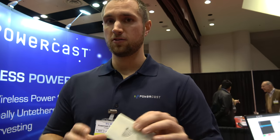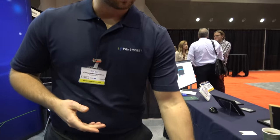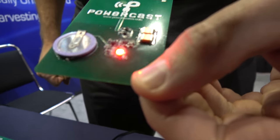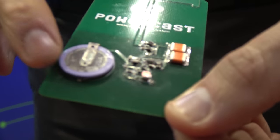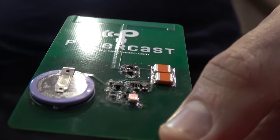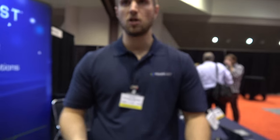It's only sensing while it gets near an RFID reader — that's the disadvantage. These will work up to 30 feet from an RFID reader, all working at 915 megahertz, so that's a pretty far range. But you still might not always be in the presence of an RFID reader. That's why we have something like this, which shows battery recharging — every time you see this LED flash, we're putting a chunk of energy back into this rechargeable battery. You save the cost of sending someone around to change batteries.